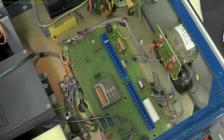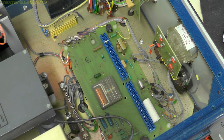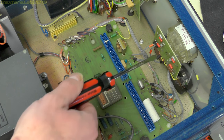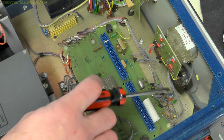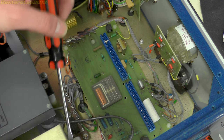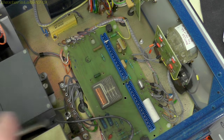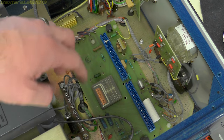There's another trimmer down there. The two voltage controls are Colvern branded like that other big trimmer, and by the sounds of them when you turn them they seem to be wire wound as well - that's nice. We can just see the backs of the panel meters with a small board on the back of each one. Looking at the wiring from this one, it seems to partly come over to this high voltage filter unit - so I suspect they're probably measuring the output voltage at this filter point. This is a big box that looks like it's completely potted.